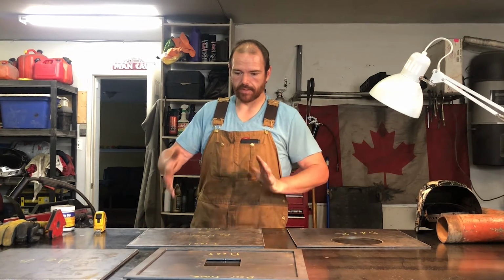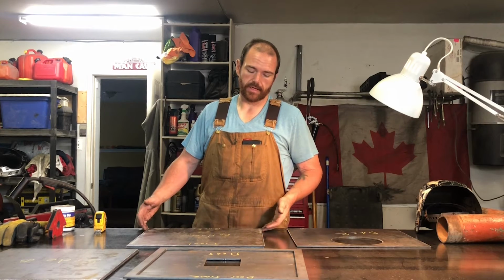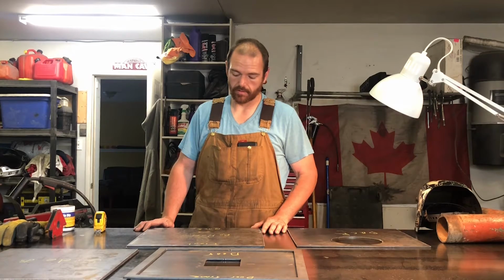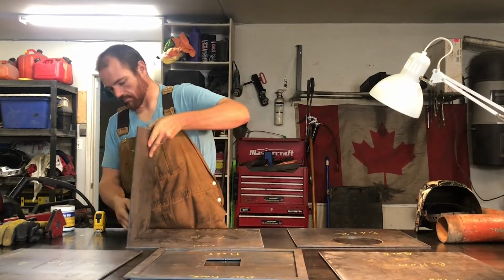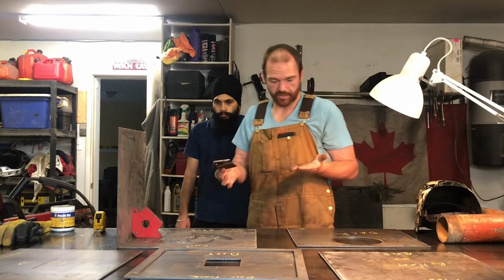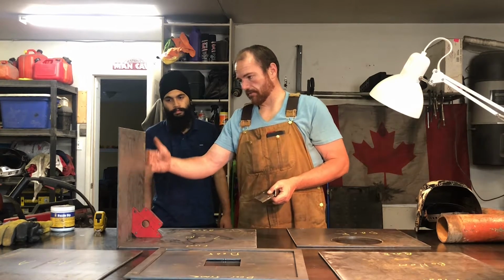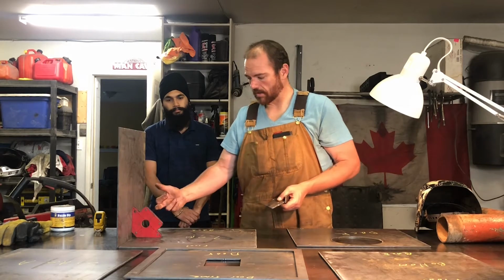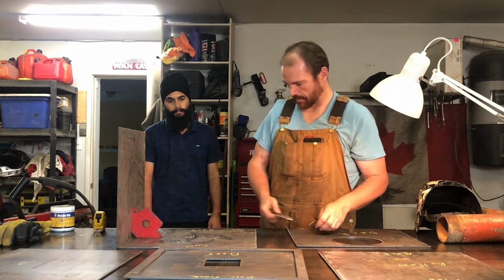In order to keep it as nice as I can, I'm going to use some small cut-off pieces of 3/16 steel as blocks, just to help align the bottom and the sides. So once again, the tickle trunk provides. These blocks are going to help us lift the sides so that we have a good cross section for weld, and so that we maintain our 16 by 18 dimensions.